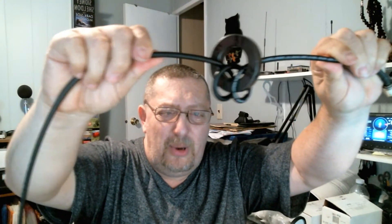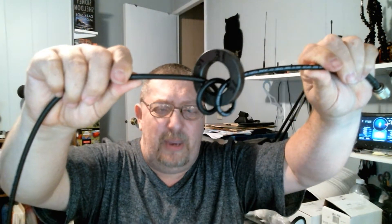If you happen to use thinner coax and want to use the toroid, you can also go through it with your coax several times. That gives you the same impedance effect, and it all works towards reducing RFI in the shack.